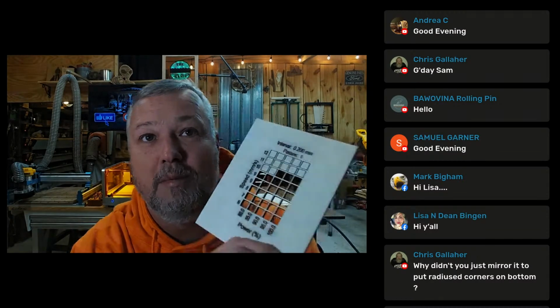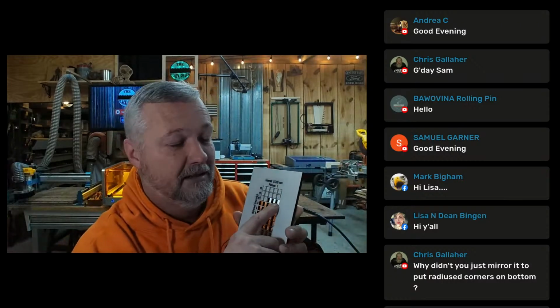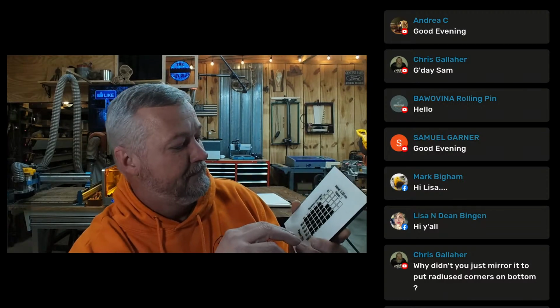I'm dropping stuff, guys. Before we started the project, and if you weren't here for it, I did speed tests before I started this because I need to know what my speeds are. And so, looking at this and knowing what I know about wood, you do not want to go all the way up here as fast as it'll go, because let me let you into something on wood. Just because this little spot of wood cut at 10 millimeters a second, there's really good likelihood that if I do an entire big design at 10 millimeters a second, there's going to be a glue pocket, there's going to be a knot, there's going to be a void, there's going to be something that's going to cause me a problem if I run 10.